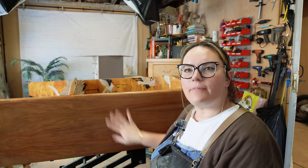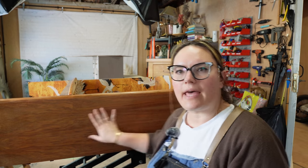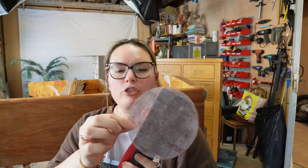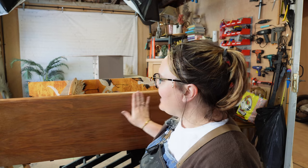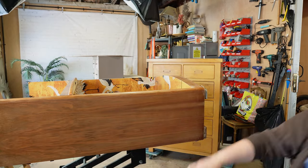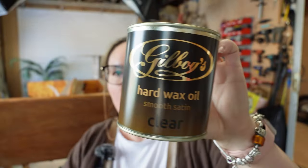I'm going to start working on the outside again. If you remember, the last thing that we did was put some of that wood primer on. So I'm going to use my Pioneer Work Sander. I've got 240 grit sandpaper on there. And I'm going to go over all of the outside, just to give it a bit of a scuff sand. And then once I've done that, I'm going to start giving it a couple of coats of this